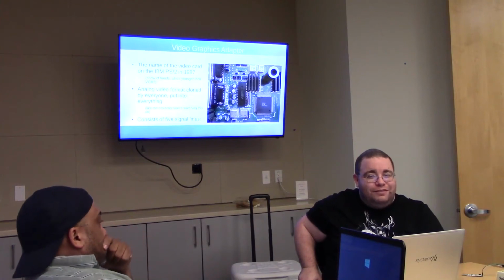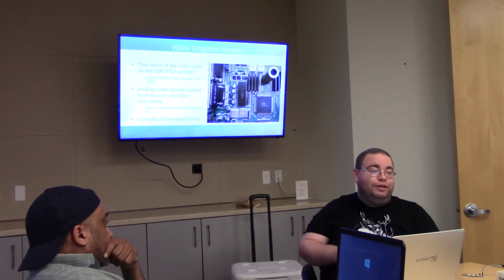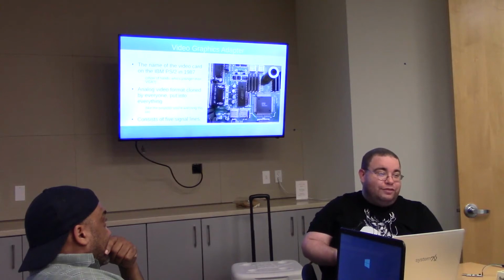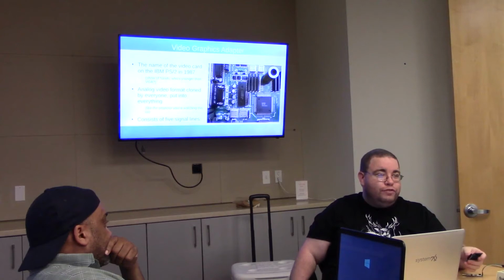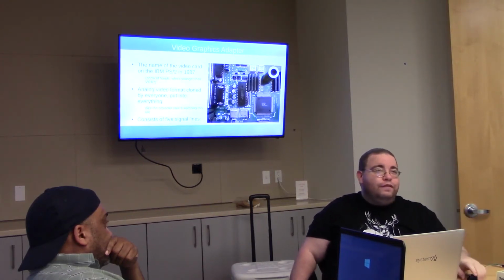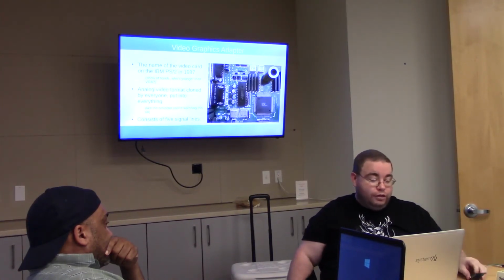Everything since then has cloned the VGA. It was a phenomenally successful standard. The product was really, really simple to implement. You can do it in a few lines of Verilog. And aside from just being easy to implement in hardware, it's also a really convenient standard to extend. There have been a gazillion different VGA modes. First was Super VGA, then XGA, WVGA, QVGA. I've got a phone book-sized manual at home, the programmer's guide to the EGA, VGA, and Super VGA chips. That is everything you ever didn't want to know about VGA, and it goes into excruciating detail. It's a really handy book, actually.